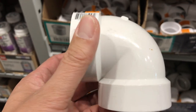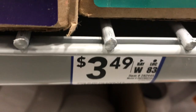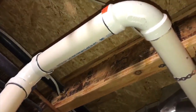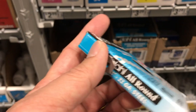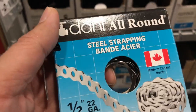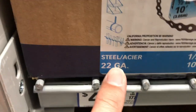Notice my first 90-degree elbow — I picked it up at our local hardware store for $3.49. Here's my second 90-degree elbow as well. Now notice my steel strappings — this steel strapping holds up the pipe. It's very important that the steel strapping be adjusted so that the pipe drops down towards the outside vent end, maybe an inch and a half. The steel strapping cost $4.99.